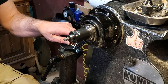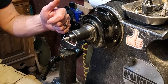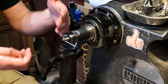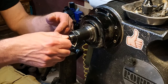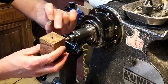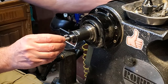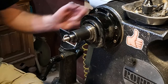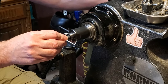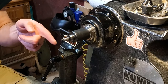I have several videos up here on different ways to do things. If you're interested, check into some of the other ones about doing inserts. To be honest, I don't thread on any of them — it takes quite a while to thread this on, and if I was only doing one or two bottle stoppers I would just use the mandrel. But if you're going to do several, I use the inserts. The reason is I can drill the hole a little bit bigger — a seven sixteenths — glue the insert in there, let it set up overnight, and then you just thread the whole thing on there just like this. You don't have to worry about screwing it on and backing it off. But if you're only doing a couple, just use the mandrel — it does a perfect job. That's really it: a mandrel, a couple of drill bits, and of course a Niles bottle stopper.